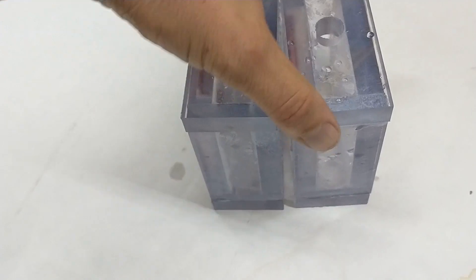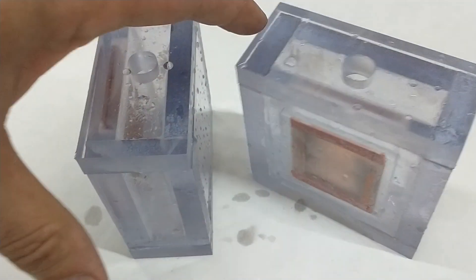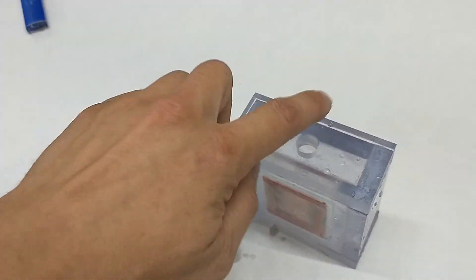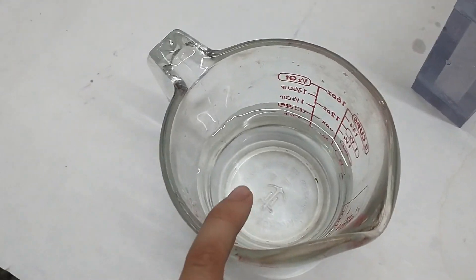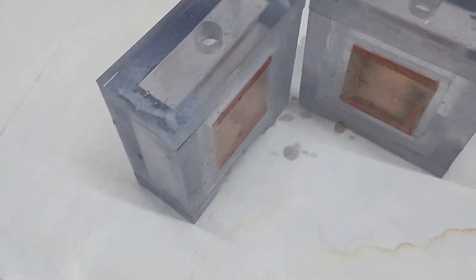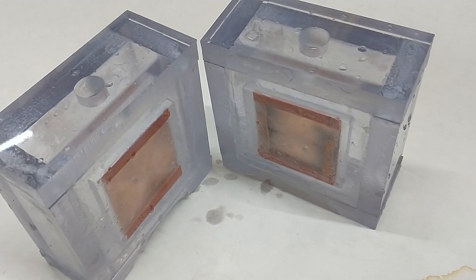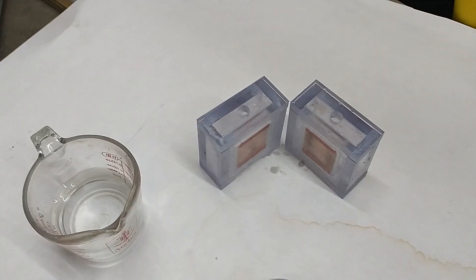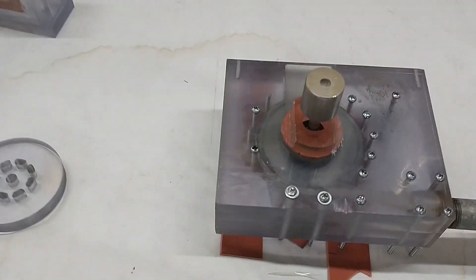I have these little boiler units with copper plates on the inside of the box. We'll fill these up with the water, record the temperature before we start the test, boil the water, and find out how much time it takes to raise the temperature. Because we know the volume of water, we will know how many watts we've produced in that amount of time.